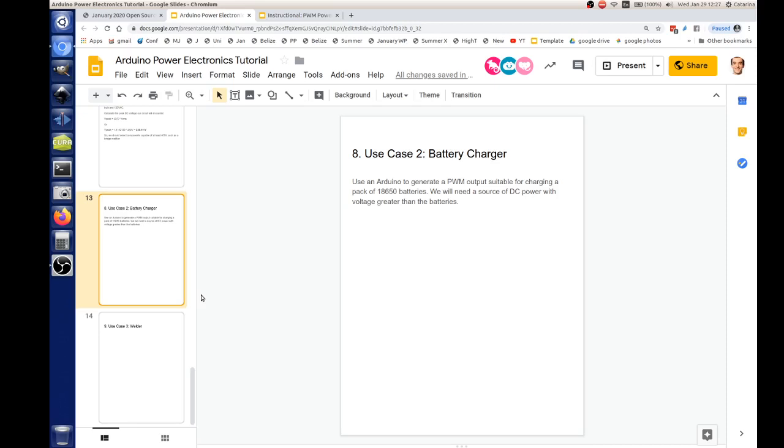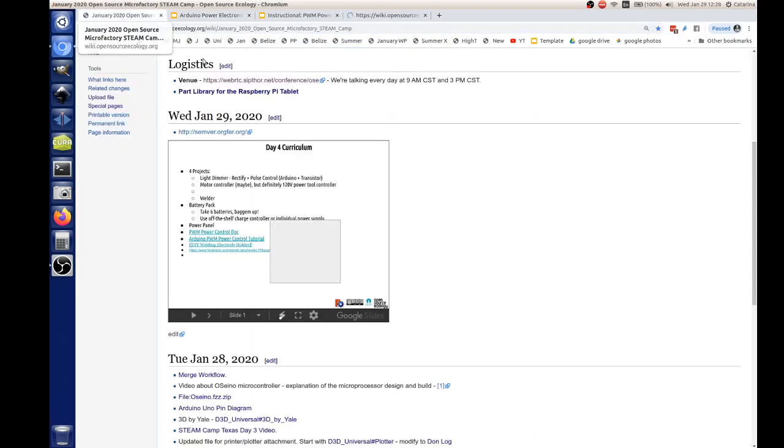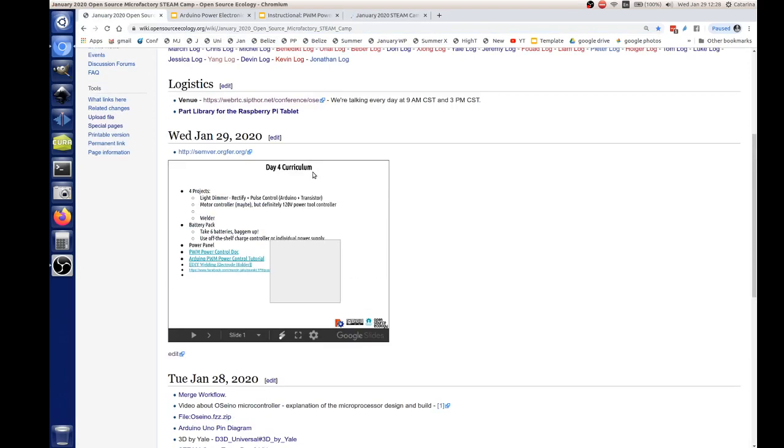Yeah. I found that 24 volts ended up not being enough voltage to create a good arc. It would start doing it, but then the rod would stick and the whole rod would turn red and melt. So that didn't work out too good. We need a little bit more voltage to maintain the arc.